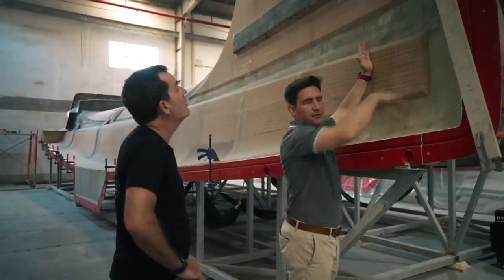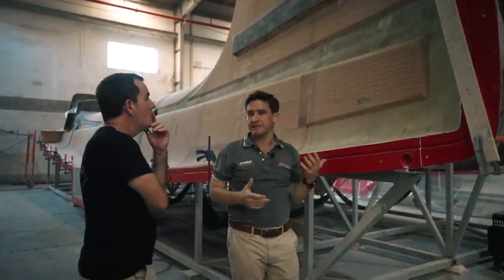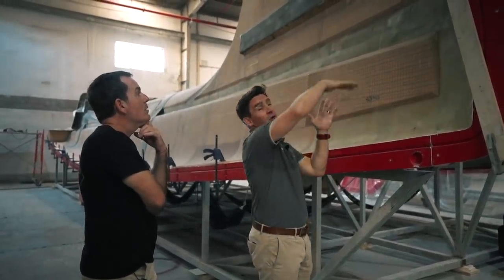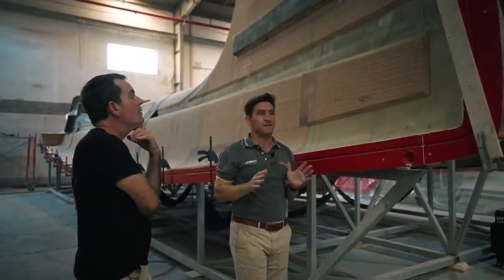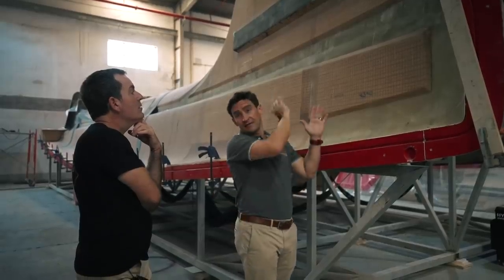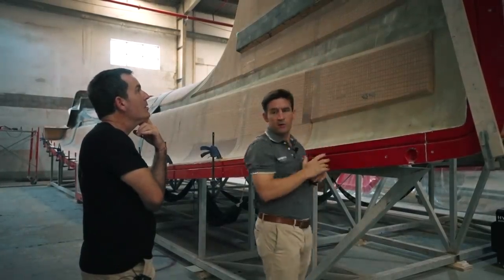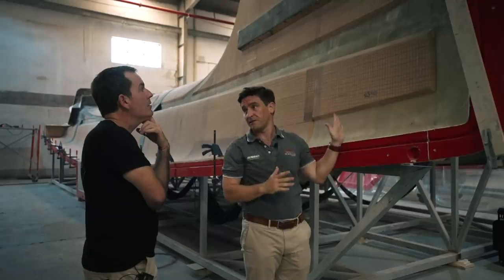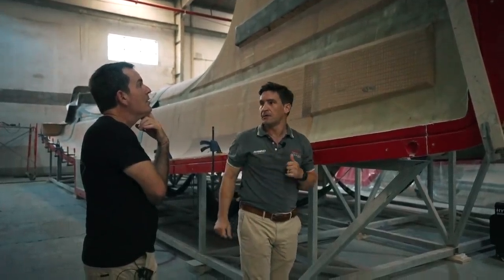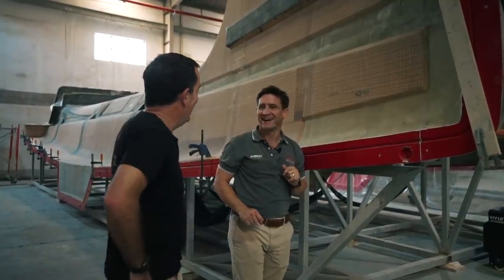Typically when you're looking at impact, you're normally looking fairly low down. But we recently had an 1160 out in the Pacific that hit something and it really did tear quite a decent height. That 1160 was fine — they sailed for about 10 to 12 days with basically the front half of the boat missing. We had that same system on the 1160: a full height watertight bulkhead that was glassed only on the back surface, which is certainly strong enough, and they made it home no problem. It's a critical, critical bulkhead in the boat. Did they need to change their underwear? I think so.